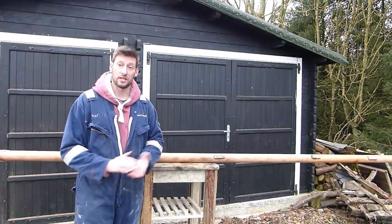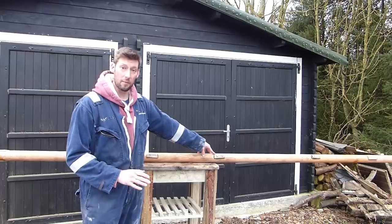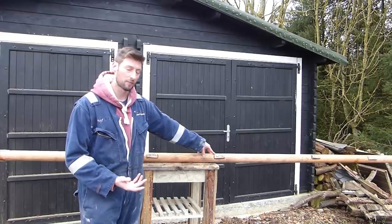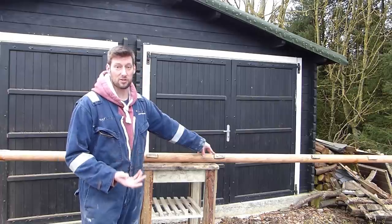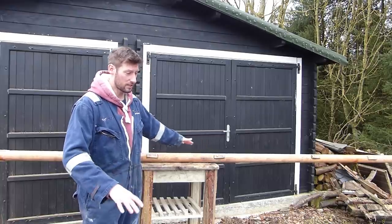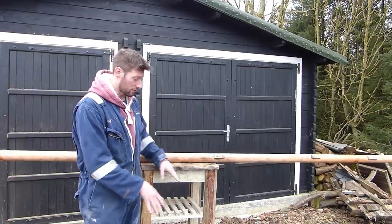So what I have decided to do is, once I put the acid onto the wood, I work that in, clean it up, we then wash that acid off. Now I've got two options, I can use an alkali solution or I can just use lots and lots of water. The volume of water is going to form part of my method of disposal, and that is I'm just going to douse it, I absolutely soak it. Now we have a natural sink here anyway, lots and lots of water is going to neutralise the acid, so it's not going to have any lasting effect on the ground itself.